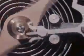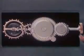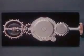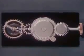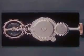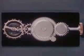But the balance wheel keeps swinging, and the jewel pin moves the fork end of the pallet until the escape wheel is again unlocked. But when we connect the mainspring directly to the escape wheel, the power is soon exhausted — in an actual watch it would last only a few seconds. What we need is a way to stretch the power so it will last for more than a day.